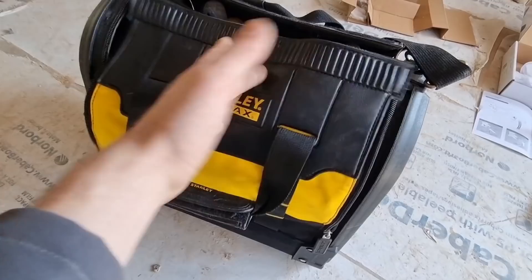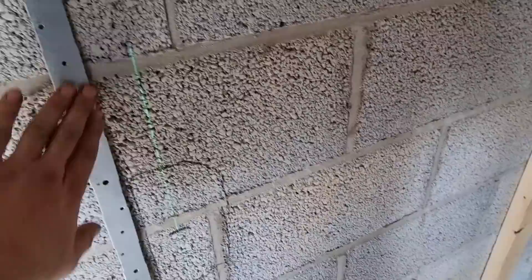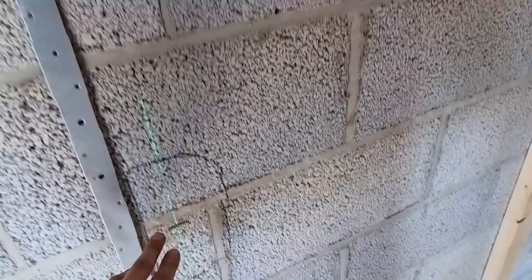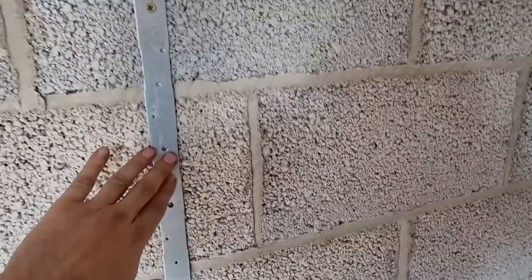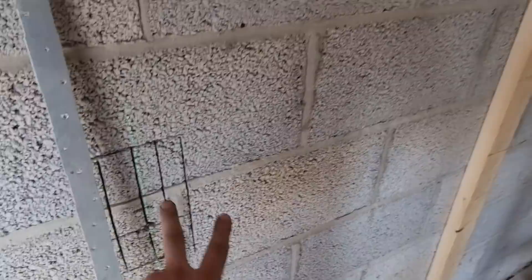The zip's a little bit broken on it - I think it came like that. It's already split at the bottom but I'll keep it, it was only fairly cheap. It's a little bit easier than the old tote bag I had, not as good as the PB one but does me. Typical - dead in the centre of the shower where they want it, right where that roof strap is. I've just unscrewed it - I guess I can just probably move it across a little bit just to get it out of the way. I'll get all this chased out using PPE - I'm going to drop 22mm straight down into the floor and pick them up, then take just 15s across into the studding. I'll ask the builders if it's okay to just move it across a little bit. What I always do is cross-hatch it out and then you can just chisel these out quite easily.